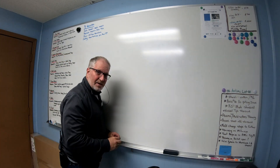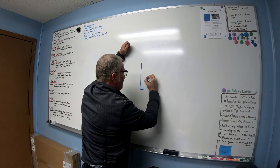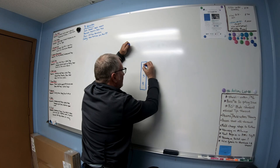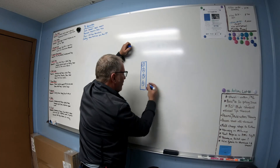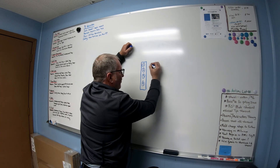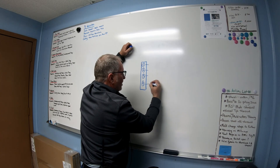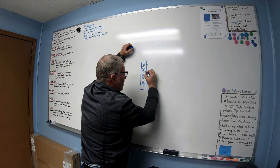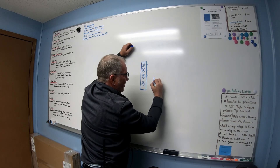Let me show you a couple of different scenarios. Say you have a rectangular part with gate one, two, three, and four — these are your valve gates. Some people fill from the center out, some might open all four gates at the same time. If you open all four together you get a circular flow front from each gate. Or you might open gates two and three first to get a flow front, and you could end up with a knit line in the center.